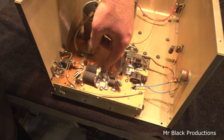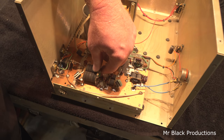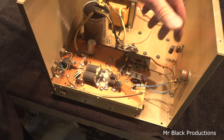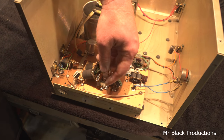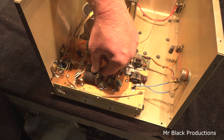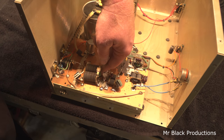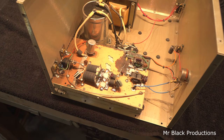What are the parts that come off of here and go to ground? That's right, our 120 puff capacitors. I don't think they were ever installed from manufacture. I don't see a solder tab or nothing. So, needless to say, we're gonna add some caps here, here, and here. Interesting, right? That's what I said too.